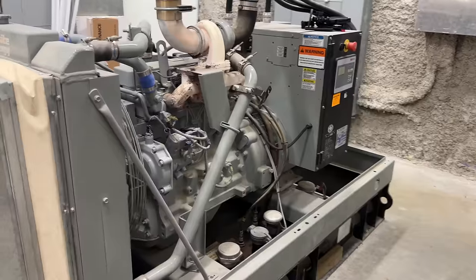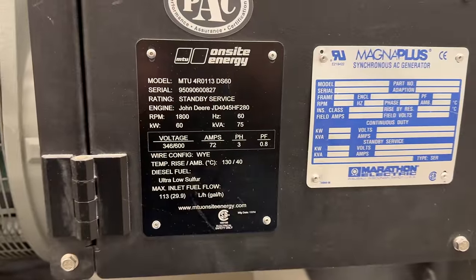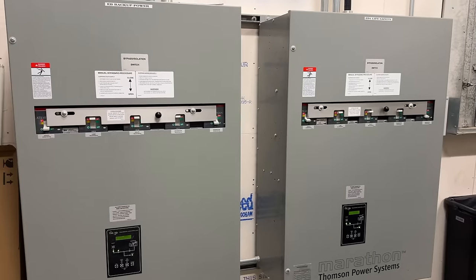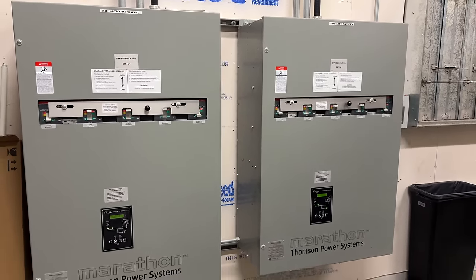About 50% of the corridor lighting is on emergency power and stairwells are all emergency power, as well as washrooms, and then other areas like gymnasiums, shop spaces, and theater have certain lights that are emergency to be able to egress and still see your way around. This is a 60 kW generator. You are required to have your backup power transfer switch separate from your life safety, that's why we have two separate transfer switches.